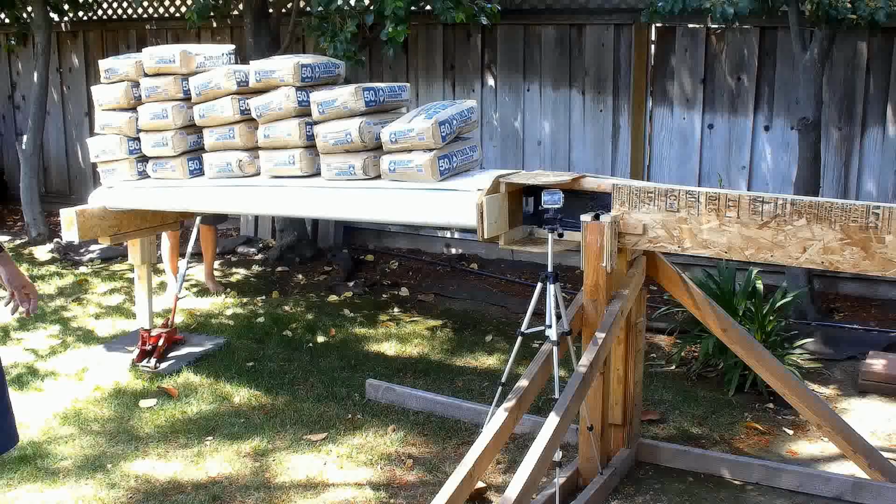Sorry for any vibration involved. We inadvertently placed the tripod of the GoPro camera on the test stand structure itself, causing a lot of vibration. You'll see the failure occur in 2 steps, indicated by spikes in the noise level. At the first spike in noise, you'll see the 2x4 lift up from the spar cap and pull the shear web components away from the attachment fitting. And in the next big burst, as the camera vibrates, is that fitting pulling loose from the shear web.